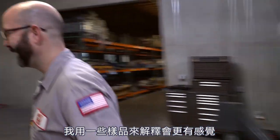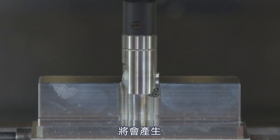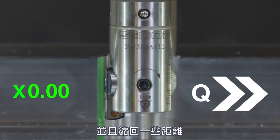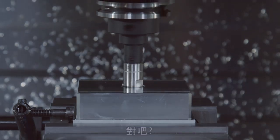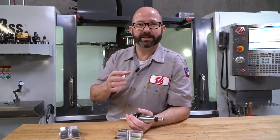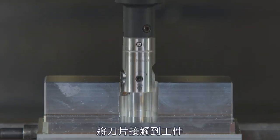This will make more sense if I have some example parts. For a normal boring operation, our tool is going to come into the spindle, start rotating, it's going to feed down, and then at the bottom of the hole it's going to orient itself and face most likely to the left. If the boring head at the bottom of the hole is facing to the left, it's going to stop and retract by a certain distance. That distance is defined by the Q value on our G76 line, and then it's going to retract up. We could just use a reaming cycle — feed down, feed up — but we're not going to use that typically with our finished boring cycles. It might leave a beautiful finish on the way down, but as it feeds back up it's just rubbing against the material, giving you a crummy surface finish. So we want to engage in the cut on the way down, retract, and then get out of dodge.